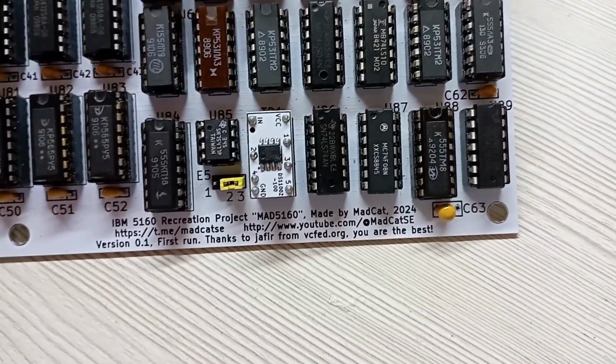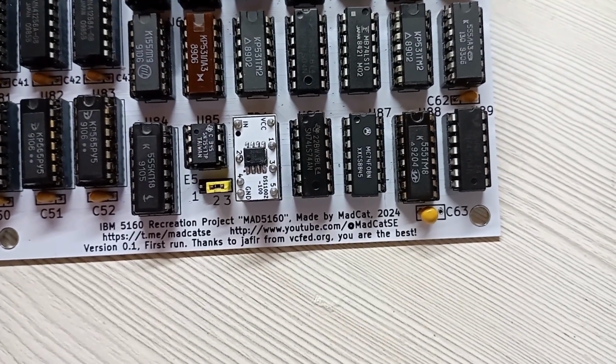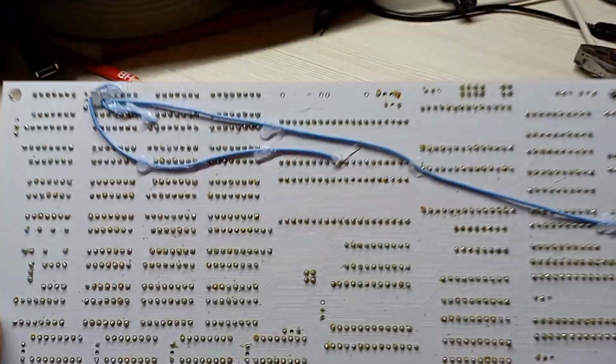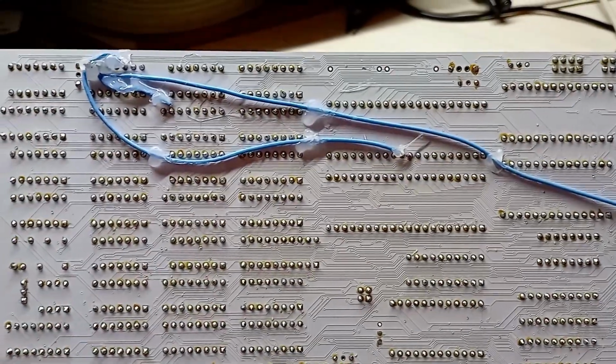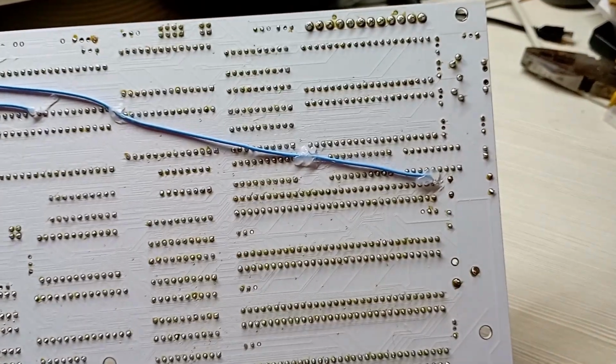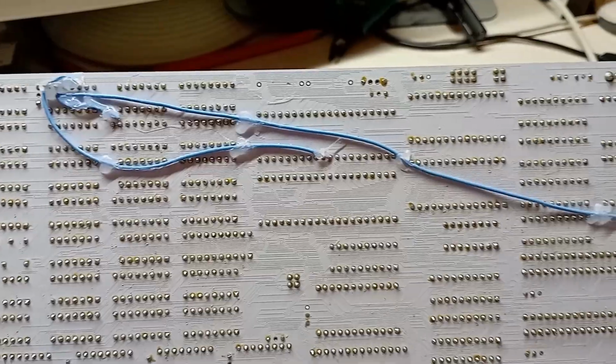I also left my contact information and thanks to the person who provided the original scan. There will be more thanks in the second revision. On the back side there is a quick fix I made to correct the parity check function. It's a testament to my carelessness when verifying my project against the corrected 1986 schematics. It's not pretty, I know, but it's on the back, it works, and that's what matters.